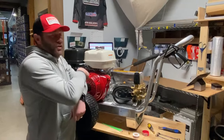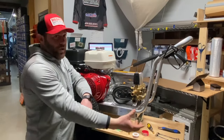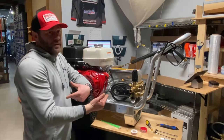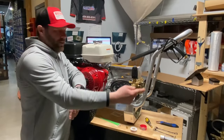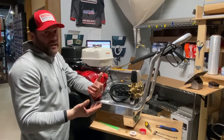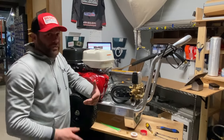You could plumb it directly into your tank so that when you let off the trigger, the water goes through the bypass hose back into the tank, then comes back up from the bottom of the tank into the pump. You constantly get fresh water going into the pump and you're not wasting any water — it just cycles from the tank to the pump, back into the tank, constantly filling up without wasting any time, money, or water.